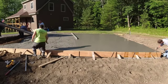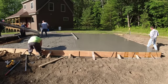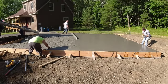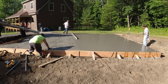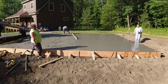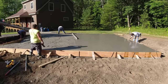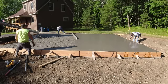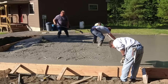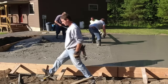Getting back to the second truck — we dump out most of it but don't completely fill the inside of the forms right away. Then we go around and mag the edges, like Eric's doing right now. We get the edges magged and screeded down so we know we're not too high. Eric in the green shirt is magging the edges, and we also have a string around there that he's checking to make sure the forms stay nice and straight.